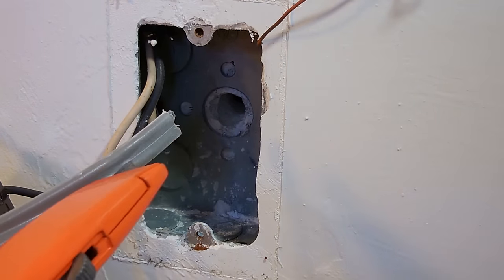Okay, the wires are trimmed to the proper length. The ends have been stripped. We're going to take this ground wire, pull it around the screw, and secure it tightly. The end of this is going to have a loop, as well as these two ends to go onto the GFI receptacle. Right here is the GFI receptacle. Now, with the GFI receptacle, you can leave the end straight because the way it's designed, you can slide the wire in behind the screw here, and the plate under the screw will squash the wire between the top plate and the inner plate.